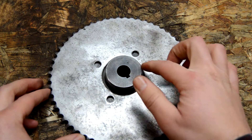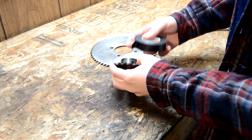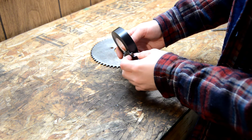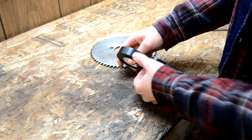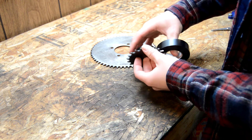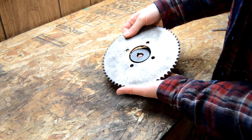What I'm going to do is go ahead and weld it on the back side, then remove the tape, and then weld in this bore as well. I'm using black electrical tape just because it has a really nice thin and even thickness, and I can wind it really tight without getting any wrinkles in it. Should be nice and even. When I start getting close to the diameter I'll go ahead and cut the tape and just kind of line it up to the hole, but I still have quite a ways to go.